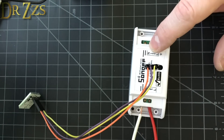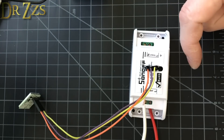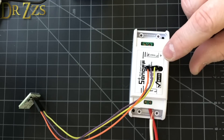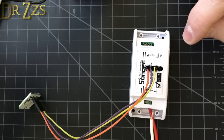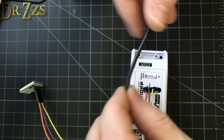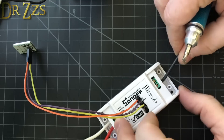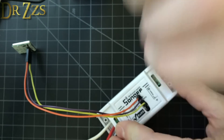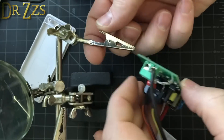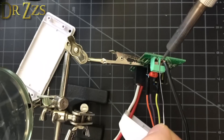Put a white wire to the neutral end — you could put neutral on the input or output, it makes no difference. All the neutral does on the inside is connect from one end to the other and pass through. The only reason to connect neutral at all is to power the ESP chip, so you could actually use a jumper-wire-sized wire for that run since the current drawn by the ESP chip is very small. Then add a black wire from the line output side. This is probably one of the easiest soldering jobs you'll do — just dump solder down there since you're never going to need to remove it anyway.